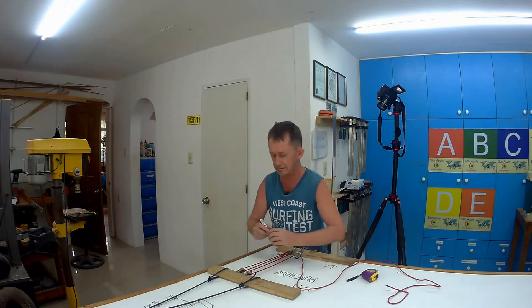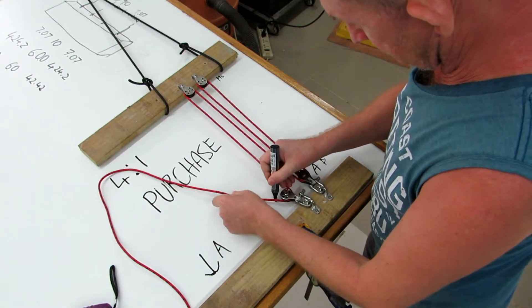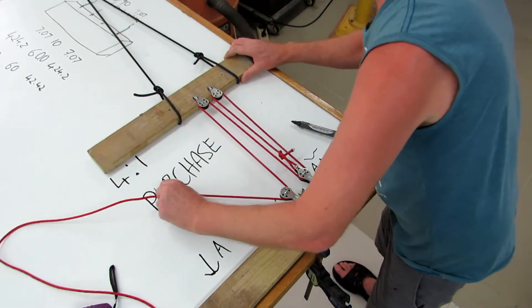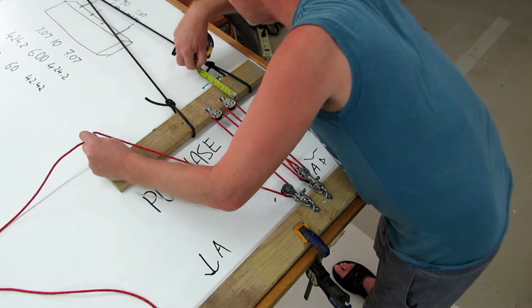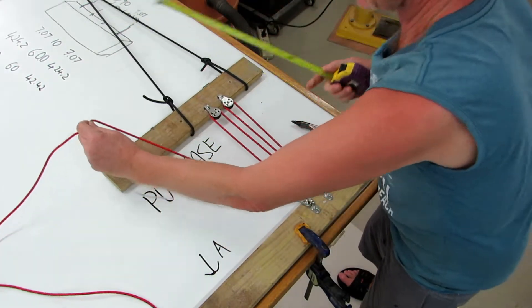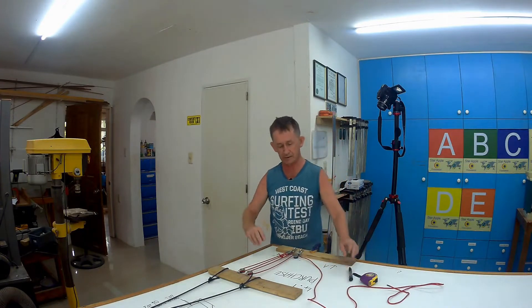To prove it's four to one, I'll demonstrate in distance. I put a mark here and a mark on the rope. I pull this end until it moves four inches. Then I measure back — it should be around 16 inches. It's 16 and an eighth inches, so it is four to one purchase — or four to one mechanical advantage, as we would have learned in school. In sailing, it's called purchase.